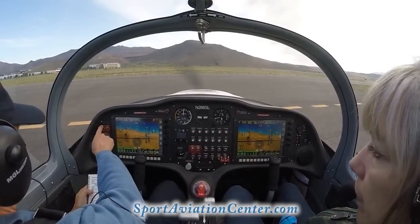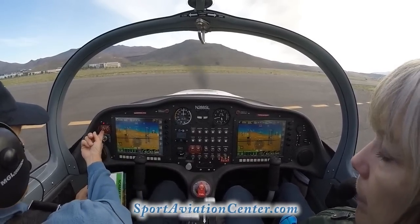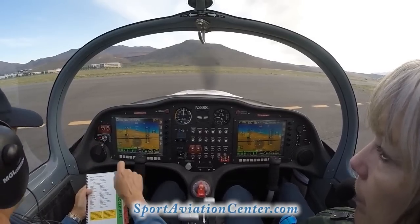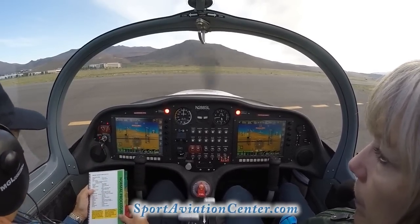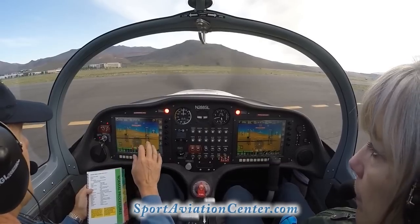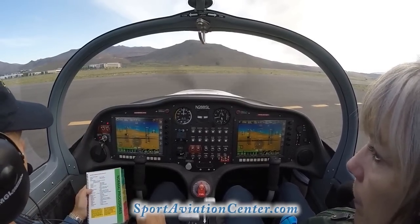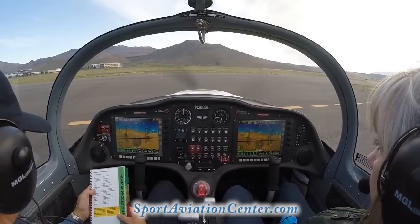So we're going to do a lane A check. We're going to switch off lane A. You see our light come on. Wait for 5 seconds, bring it back on. Now we're going to wait for the computer to check the systems. We're going to wait for that light to come off. There we go. We're going to do lane B. Okay. And we can see how we've got our little warnings here because the oil, some of the instruments are actually running off of lane B. Turn that back on. And the computer's going to check it. We're going to see this light come off. Okay, so our computer's checked that.